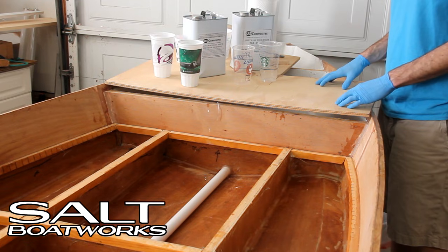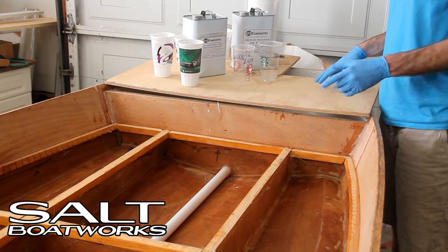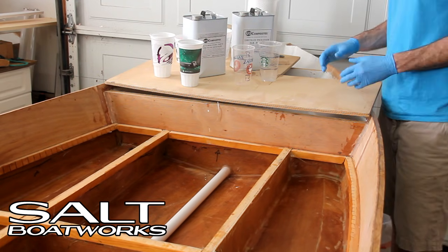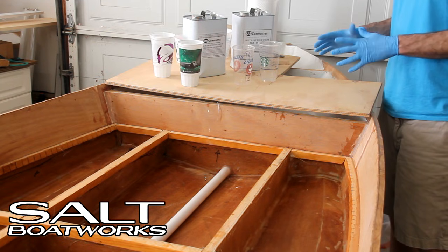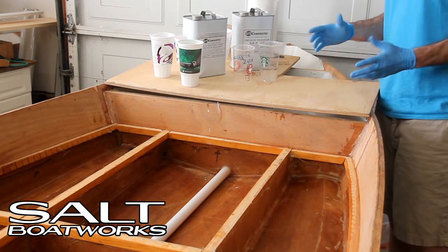All of these details are critical because foam reacts with moisture. With too much moisture in the air, the foam will not expand properly and will weigh more. This will negatively affect the foam's ability to function as reserved buoyancy, and you will need to purchase more foam than anticipated, ending up with a more expensive and heavier boat.